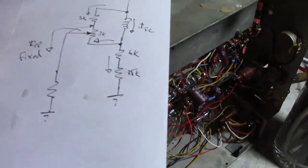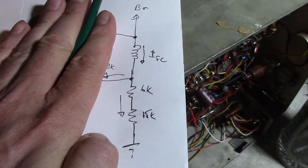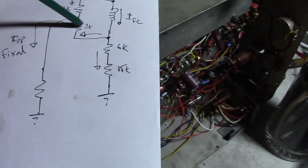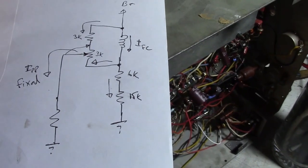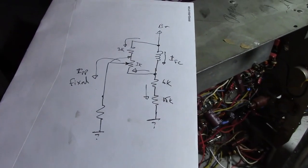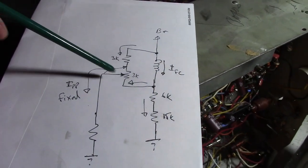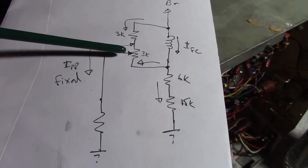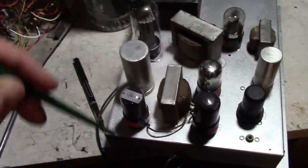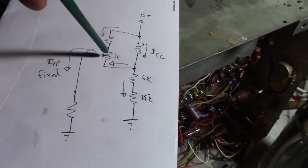If we forget this side entirely, we've just got B+ and then three resistances going to ground — fixed current. You might think, well if we want to vary that, why don't we just put the rheostat in series? They could have, but they didn't. What they did do was put the rheostat in parallel with the focus coil — 6k — except the wiper feeds a simplified version of the audio output stage. The center tap of the output transformer, which goes to the plates of the two 6K6 tubes, goes to the wiper on the focus control.